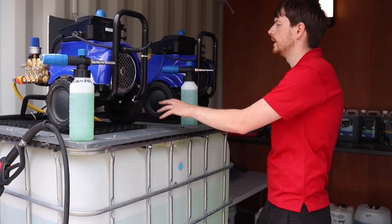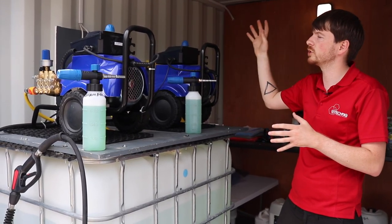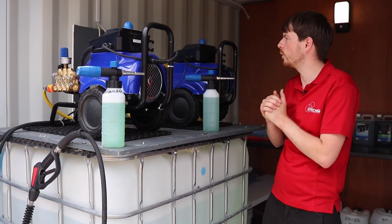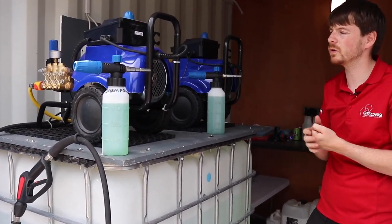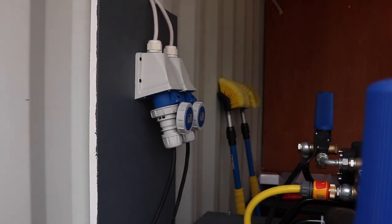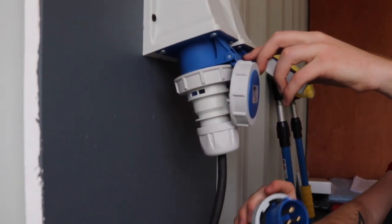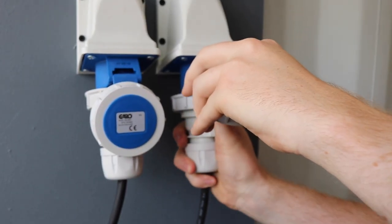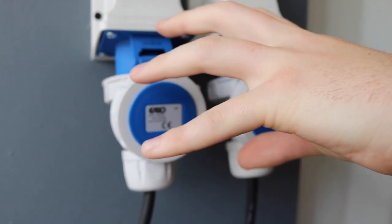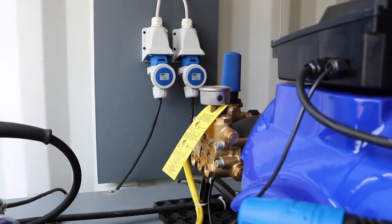Because this is a brand new build - this container is only here two weeks - the electrician wired from scratch, which meant we could pick and choose between using 13 amp plugs with a household 3-pin plug or going straight to 16 amp. I strongly recommend everyone go to 16 amp. They're waterproof, which is fantastic in this environment with moisture and rain. The unit is actually sealed with a waterproof O-ring, and once plugged in you lock it creating a watertight seal, so any splashes or moisture won't cause a short.